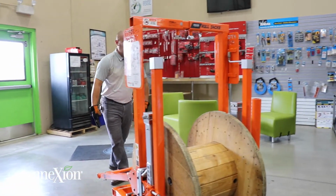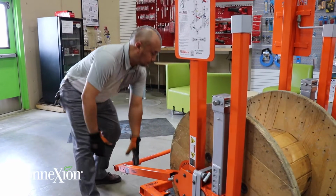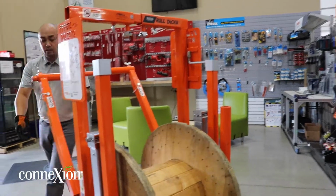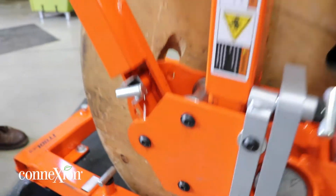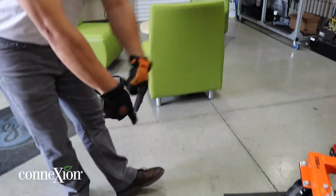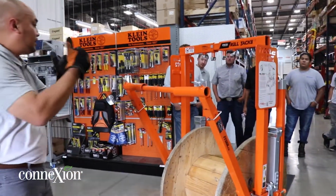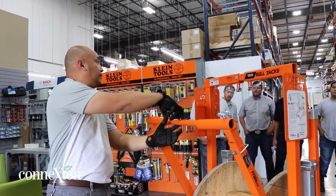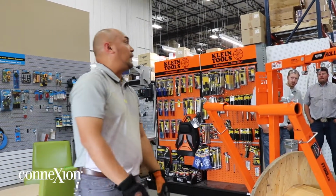Another use for this bar right here, besides the ground, okay, we're gonna flip this up again, okay? We're gonna bring it up, okay? Lock this again, okay? That pin right there. And let's say your contractor has a pole right here. There's a pipe right here, okay? So they need the extra angle most of the time, so they can pay off towards this way. This goes up about this height right here, okay? And they could hang a sheave. So now 4 conductors are going up to the sheave, and it drops down. It's a nice perfect angle as well, okay?